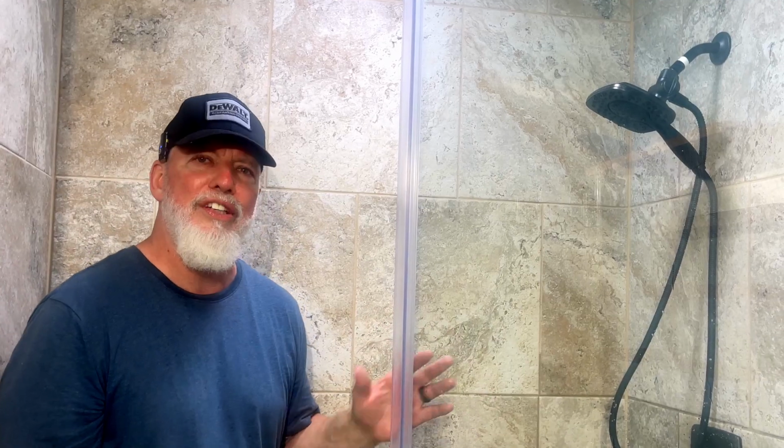All right, guys, so that's all there is to it. Now, technically, a lot of times it's easier than that. First of all, you usually don't have two like I do on this one. You're going to have just one. Not too hard. Take your time, and you can get those out, and it'll increase that flow. Keep in mind, you're going to use a lot more water than you were using before because now there's no real restriction at all.